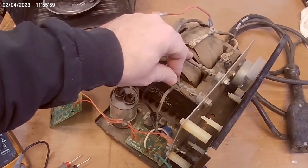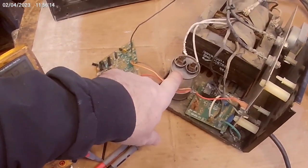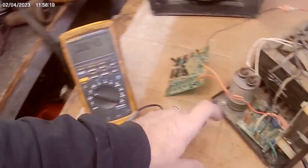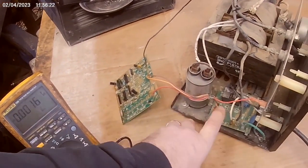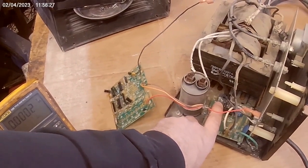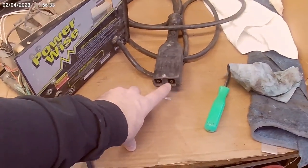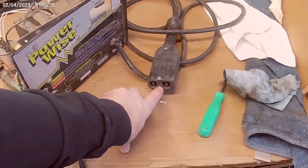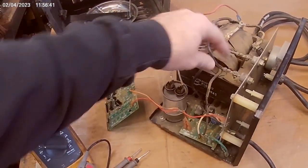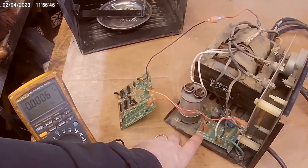It's got some larger diodes. I believe that's a 50 amp fuse coming back on the negative side, and I checked the capacitor itself — it actually tested good. I went through and jumpered this relay, basically forward biased it so the outputs were connected. When I do that, I get roughly 40 volts out here with nothing connected to it. So I'm sure the transformer is working properly and the high power diodes are working properly. I believe the problem is on the voltage feedback circuit.